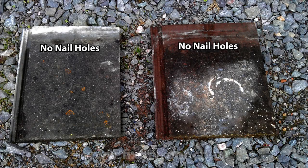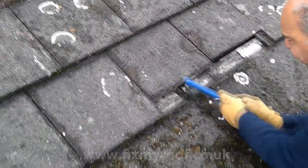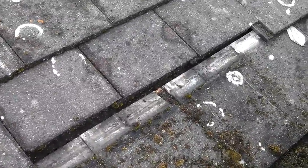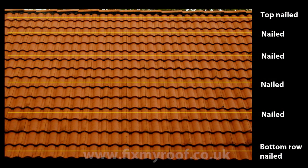It's very rare for this type of tile to be nailed, because most tile manufacturers do not make this style of tile with a nail hole. If however your tiles are nailed, to gain access to the roof, you will have to find a row that isn't, by jabbing the bottom edge of the tiles with a rubber handle of a hammer until that row pops up. This will then allow you to lever out the nailed row. Traditionally, every third row of a tiled roof would be nailed, if holes are present in the tiles. This is considered good practice and allows easier replacement of any breakages to the roof.